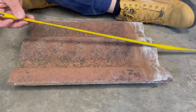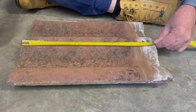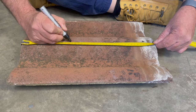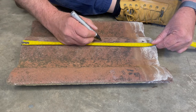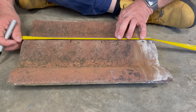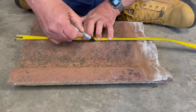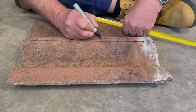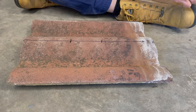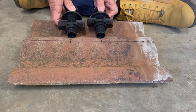Looking at the dimensions, in this case we have the first one sitting at 145mm from the bottom, which is here, and the next one another 100mm further up — which is here — at 245mm. So that's the area there. Let's go and draw some lines on that roof tile. There's the first one, there's the second one. Now let's just do a little test fit to make sure that actually works underneath, and we can see when that's there and that's there...